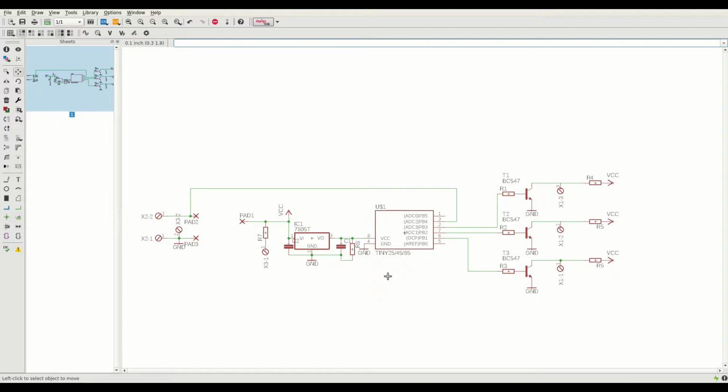Yeah, the thing that's missing here is I actually want to include battery charging circuitry. I'm not exactly sure how I'm going to do that. I might do it very, very simple. If I'm just using a single cell, and the user is, well, somewhat intelligent, you can get away with just using a current regulated 4.2 volt source.